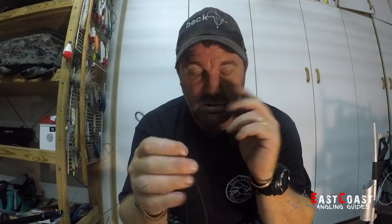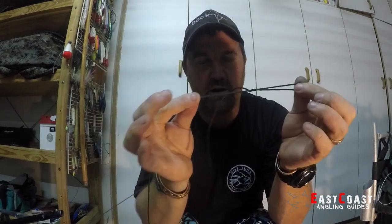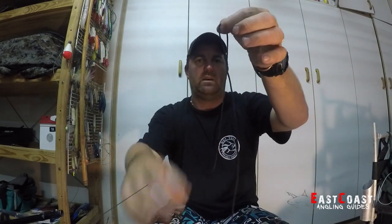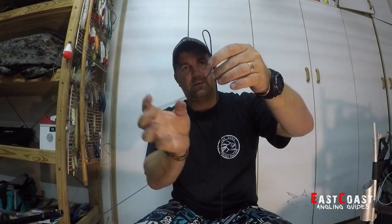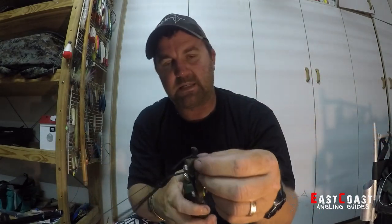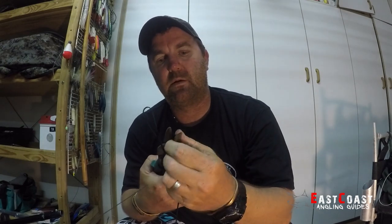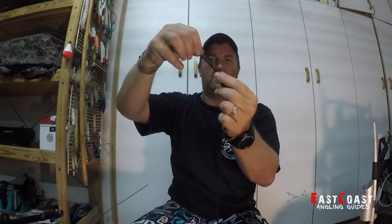One thing I don't like is when my line goes inside, and then I've got a thin piece before all this rigidity starts here, and you've got this hinge piece. I try to get away from that. So what I like to do now is this end tag, we're going to pull this inside, and then we're going to put our line up till it basically butts up against it. This doesn't have to be crazy long inside. As a matter of fact, I'm probably going to even trim this down slightly. Be fairly short, somewhere around there. This splice locks this off, so there's no other fancy knots needed to stop this loop from coming undone. That loop's not going anywhere.